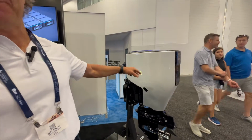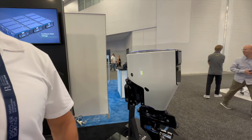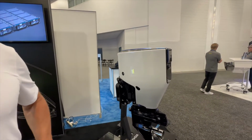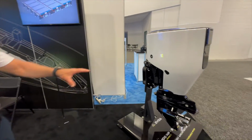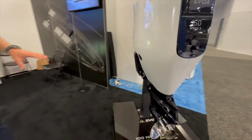It really goes to 680, but you say 800. That will be 220 horsepower. So it's continuous 150 horsepower and peak power is 220. Yes, that's a good way of saying it. It's all cooled. You use the same cooling pumps as you would on a traditional outboard. Your point, they pull up to cool the engine.